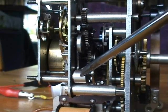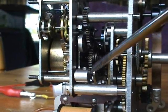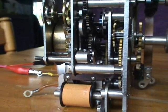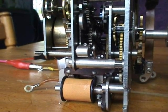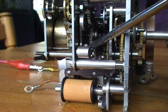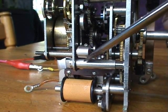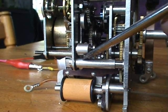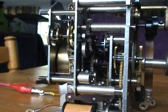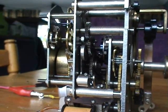This weight here — when the mains is energized, it will stop the escapement. That is a type of lever which is controlled by this coil underneath here, and it is activated when the power is on. This bolt engages and it stops the escapement. Then every 12 hours there is a self-test which releases the escapement, to avoid it going sticking — and I'll show a demonstration.